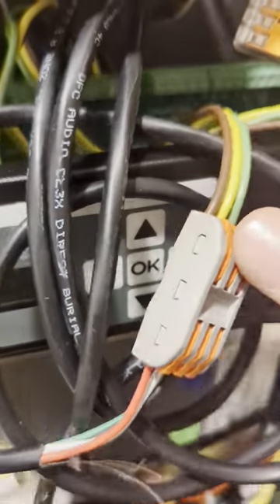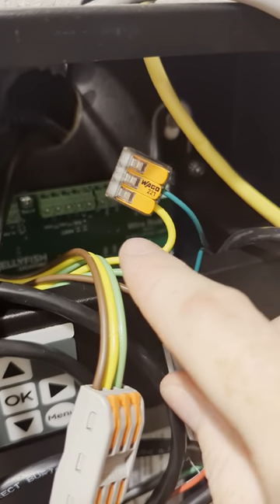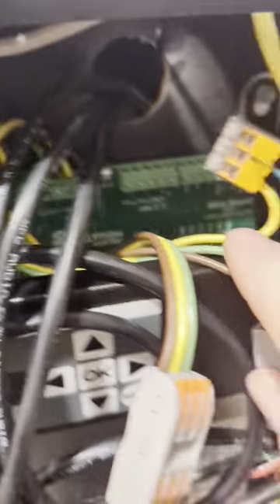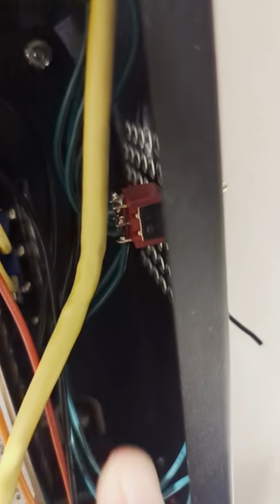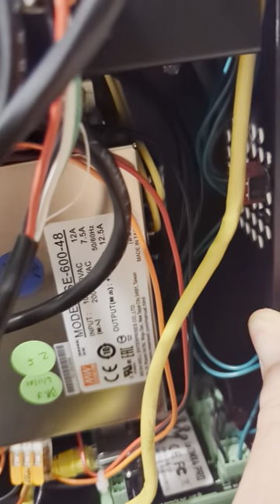Back to the Jellyfish wiring — on the runs I've taken over from the I/O board, I've got a WAGO to a wire and then a return wire that goes to my lights. That comes from a little toggle switch over here. Very simply, I've wired in from my DMX King device and from my Jellyfish controller, with output on the center pole. So with the box closed I can select between Jellyfish and third-party, making it very simple to change over without rewiring the box every time.